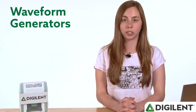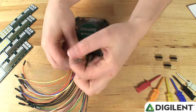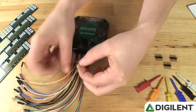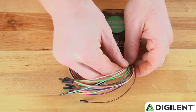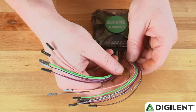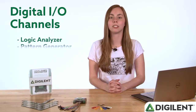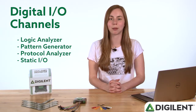The waveform generators are used in the waveform generator tool and the network analyzer tool. After the second set of ground wires, the next set of wires are external triggers 1 and 2. The gray wire corresponds to trigger 1, and the gray wire with the white stripe corresponds to trigger 2. These can be used in any tool where you're able to trigger with signals from an external source. The last eight sets of wires correspond to digital input and output channels 0 through 15. They alternate between pink, green, purple, and brown, with the bottom set of wires having the same color scheme but with an added white stripe. These wires are used in the logic analyzer, pattern generator, protocol analyzer, and static I/O, and can be configured to any combination of inputs and outputs based on the tool's capabilities.